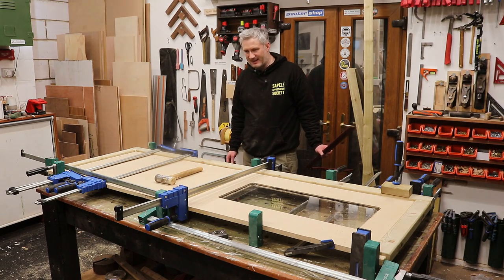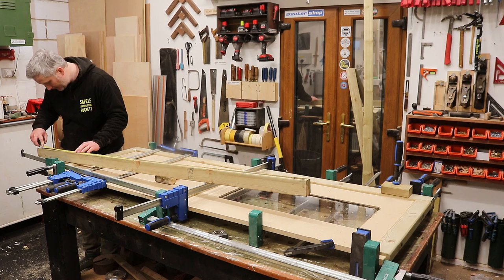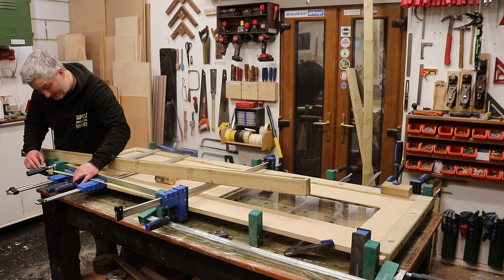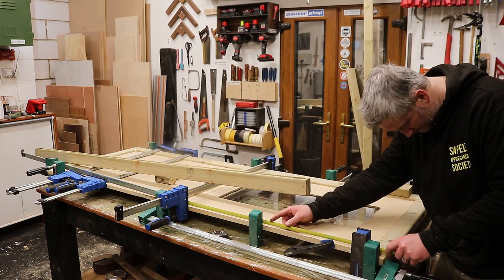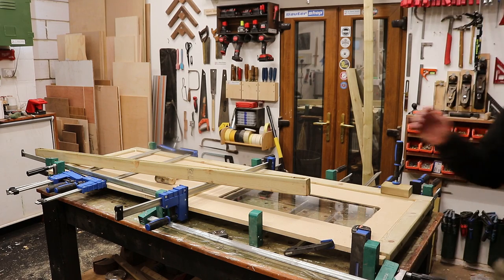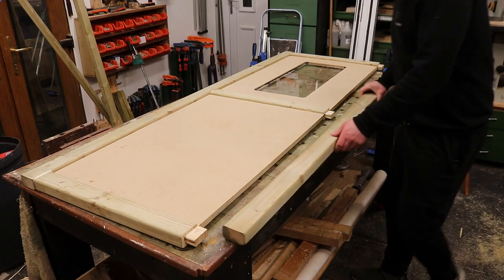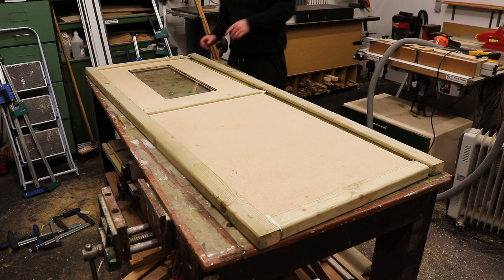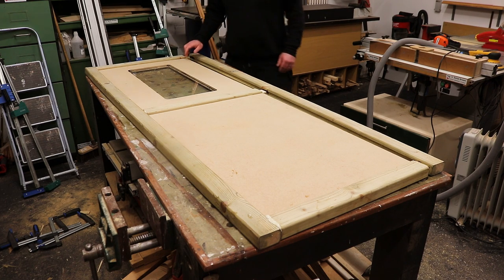So not great but hopefully it'll be salvageable. What I'm going to do just before I leave this to set is measure the distances between my mortises and double-check that against where my tenons are. So that's 869mm — that looks like 869mm to me, so that's good. And I've got 836mm there, and that looks like 834mm, so I might have a bit of trouble at the top. I was anxious about this one, so I ended up coming out in the evening once the glue was dry to remove the clamps. The bottom and centre mortises line up pretty well, but the top one is off by a couple of millimetres so I'm going to have to pare some off this tenon to get it to fit.